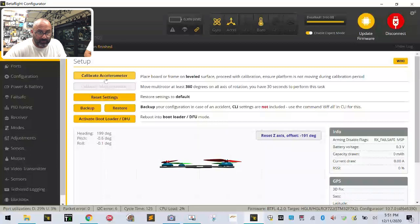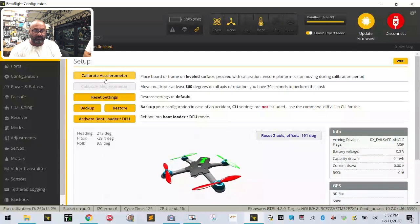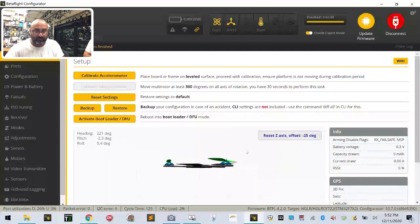Now with both my hands on here pressing on that chip, it's done moving. We're at 199 degrees. Oh, sorry, my fan just moved. But at 200 degrees, let's see if I can just hold my breath for like 10 seconds. All right, so I would say we would rework this as well. That's just a little mess up on it, but I think it's the gyro being reworked. I think this board has a few little areas that need to be reworked. Did you have any problems with your OSD? No.